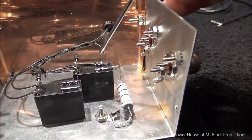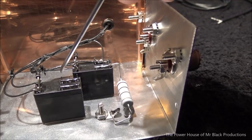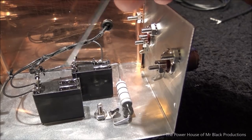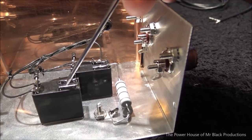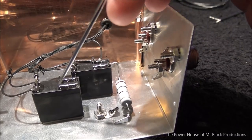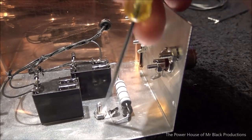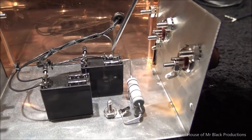Let me think about that for a second. So, Icom, receive, RF, RF from source to here. This wire goes to here. This wire, when we go into transmit, this will be our source. We'll switch to here to this lead. This lead will in turn switch to this lead. That lead will in turn switch to this lead. Okay, so then this one needs to go back to ground. So when this radio comes out of transmit, this lead here goes back to ground. Perfect. Everybody got that?